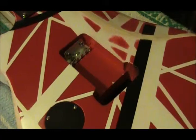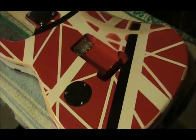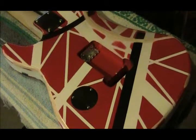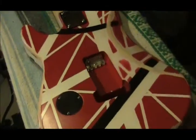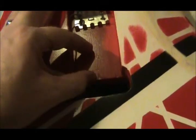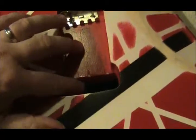I'm ready to do my grinding. I decided to do this as body work instead of taking the bridge apart, because part of the point was what you get for 200 bucks — if I start swapping out parts it's cheating. If I grind this out, you can see how much bare wood there is from all the routing I've had to do to get the bridge to fit. I can hit this with spray paint again and make it all nice and red inside. I'd rather make a ramp just to here — bring this down about an eighth of an inch and back about an inch — taking a strip of wood out this wide.